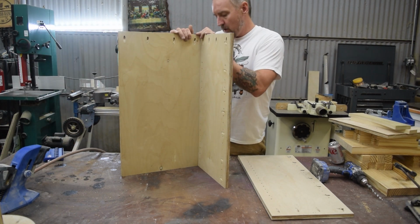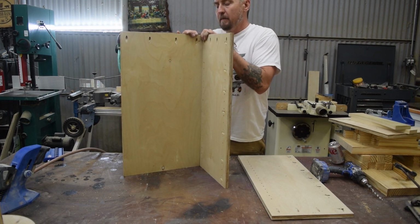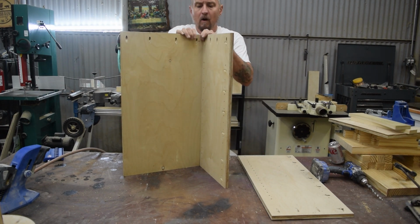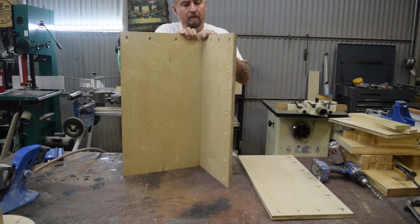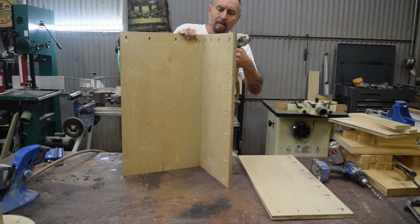That way I usually don't have to worry. My saw is really accurate. I've got it dialed in really well. So if I just perfect one corner at a time, then by the time it's all said and done, I should be perfectly square. So I'll just align this corner and I'm going to brad nail it.